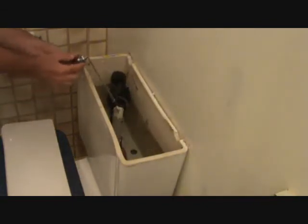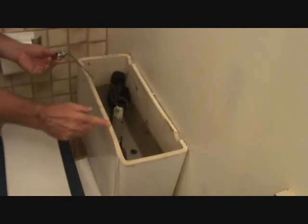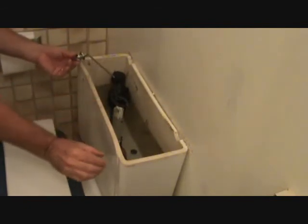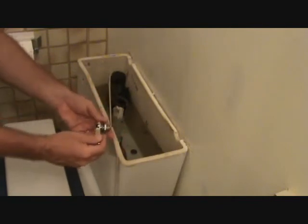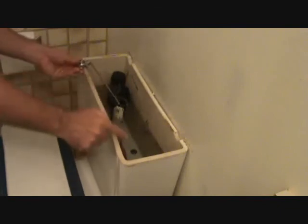Here's something I don't want you to miss. Remember I told you that the threads are always reverse threads? Generally, anything on the left-hand side of the toilet — and most toilets have the handle on the left-hand side — I've never found one that has regular threads. They've always been reverse threads. But I do want to caution you: there are toilets that have a handle on the right-hand side, and I'm not quite sure if that one is reverse threads or not. So be really careful when you're undoing your nuts — wherever your handle is, realize it could possibly be reverse threads. As you're undoing it, be very careful.